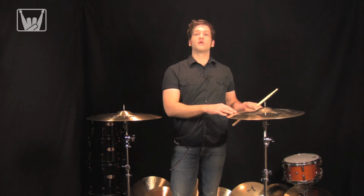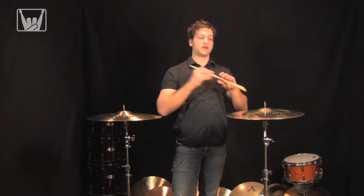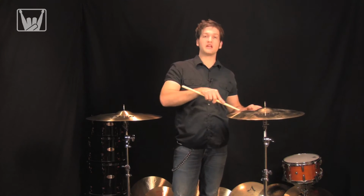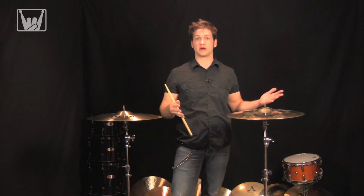On this cymbal here, when they're spinning out a cymbal during the manufacturing process, they'll have it up and rotating, and a cutter will come in along the edge as the cymbal's spinning, and it'll move its way down, just like a needle on a record player.